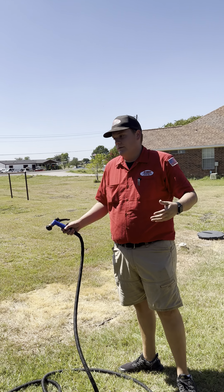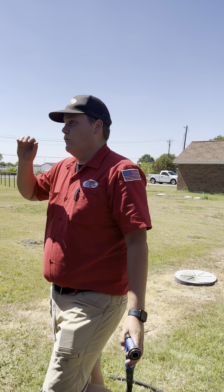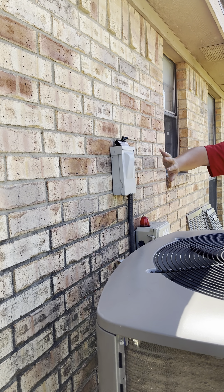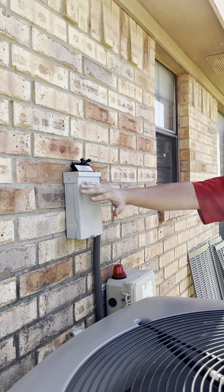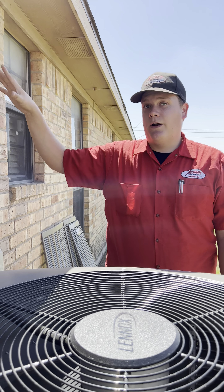All of us know we can't breathe that well. One thing that we do and one thing that homeowners can do is come out here and wash off your condenser coil. One thing you want to start off by doing is right here on the wall next to your unit, you should find a little box like this. This is what we call your service disconnect box. It's a device that we use to basically cut off power without going all the way out to the breakers. If it's easier for you to do it at your panel breaker, do it at your panel breaker — whatever you feel comfortable with.